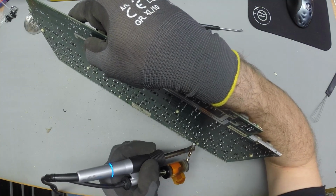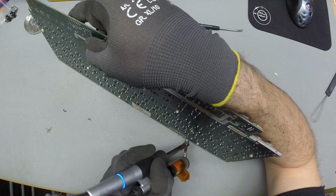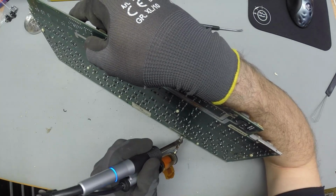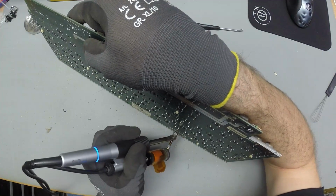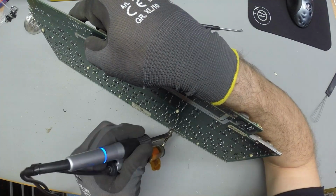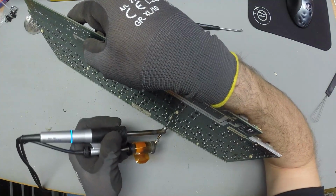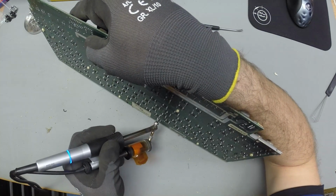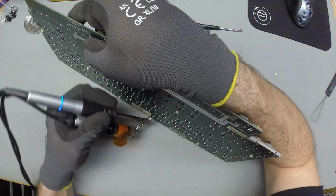The bent legs on these diodes drive me crazy. Why oh why? So random. They probably did this to keep the PCB and the plate aligned. Probably the PCB mount switches weren't strong enough, or the fit wasn't tight enough to hold on to the plate. So they thought, hey, why not bend some diodes?